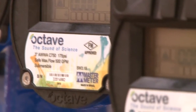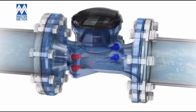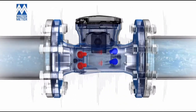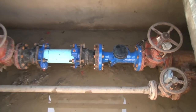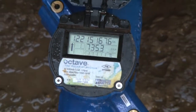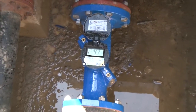It has no moving parts. We're sending a sound wave through the meter — one going with the direction of flow, and we time how fast that beam travels across the pipe. Then we shoot another beam the opposite direction, against the flow, and measure the time of it. If you have no flow in your pipe, both beams measure at the same exact time. But as velocity increases, one speeds up with the flow and the other slows down going against it. You just take the difference in time of those two to determine how fast water is moving.